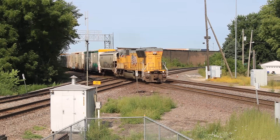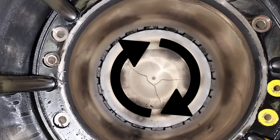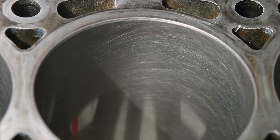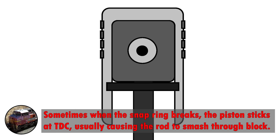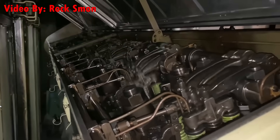Many EMDs, however, possess something far cooler than a replaceable head, because their pistons are actually free to rotate a full 360 degrees within their cylinders. This is done simply to ensure even wear on all sliding surfaces, and it also helps to maintain the crosshatching on the cylinder wall, which is crucial to proper oil retention and dispersal. These rotating pistons sit on top of a piston pin carrier, and below that there's a groove cut into the piston itself that holds a big snap ring, which keeps everything from coming apart on the combined intake and exhaust stroke. Nothing but the vibratory forces of the engine causes these pistons to spin.